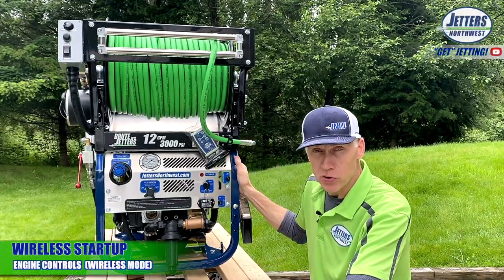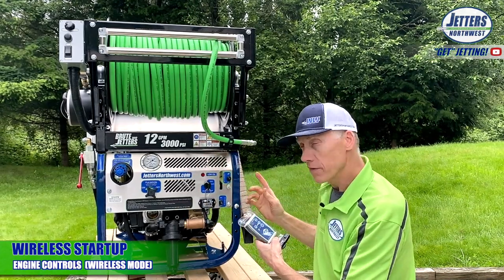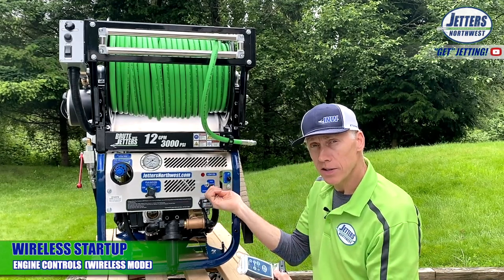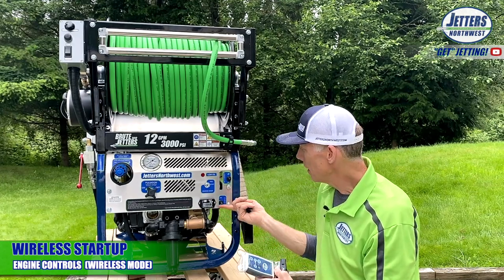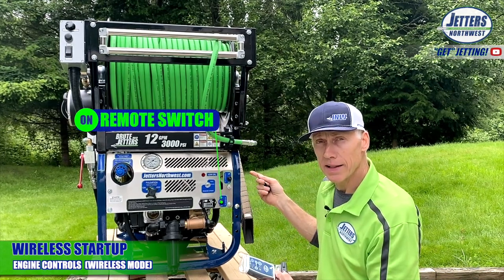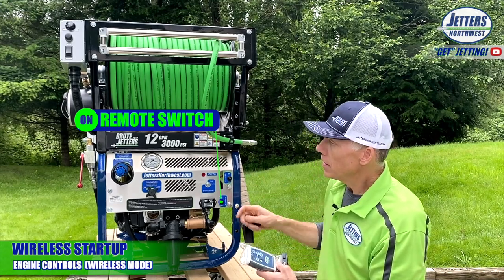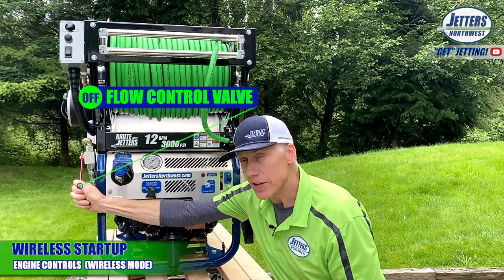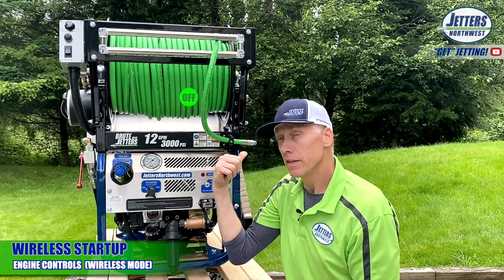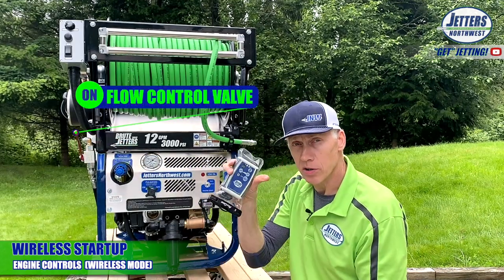Now for those of you with wireless remote control, let's talk about controlling the throttle with that. First, I'm going to take the key out so nobody gets confused and tries to turn the key on and off. And I need to next turn my remote switch on. You hear that valve in the back? That's the wirelessly controlled jetting valve getting set in the safety position. When we take this valve and have it down, we call that the safety position. But when I go to jet wirelessly, the machine automatically puts the secondary valve in safety, so I bring this one all the way up to control my jetting right here.